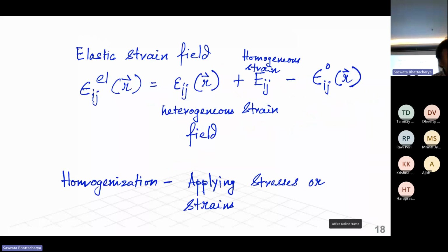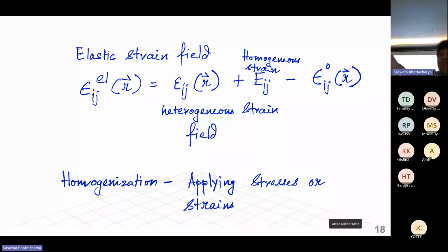For example, the homogeneous modulus approximation may not be correct for some cases. For most cases like precipitation, it is fine and it's actually a very good approximation, because what you want to see is how the precipitate shape changes with size. In general, you will see for isotropic interfacial energy, a precipitate appears as a spherical or circular nucleus. Then it grows, and as it grows, it changes shape. And shape change with size is a very, very inherent property in solid to solid phase transformations.